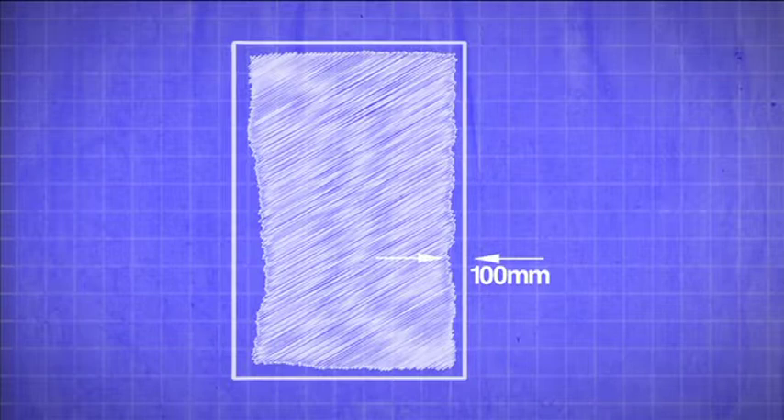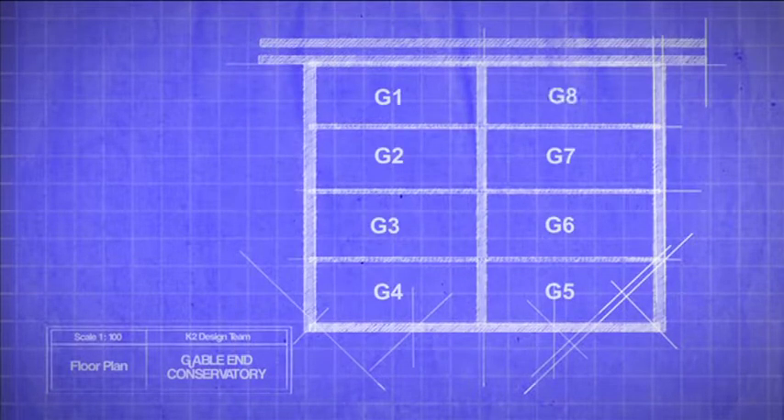The inner protective film can be completely removed once all plaster work is complete. Start with the roof glazing sheets against the wall and to the left, with the face that had the printed film facing outwards. This first sheet will be labelled as G1.